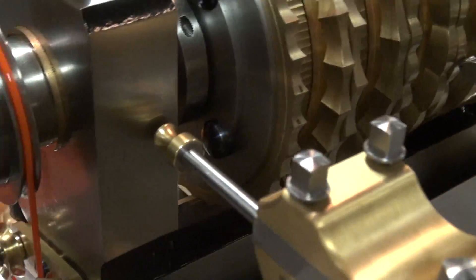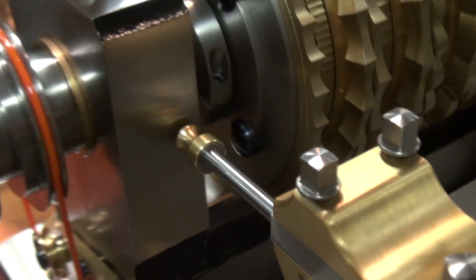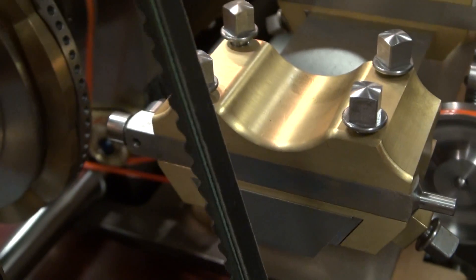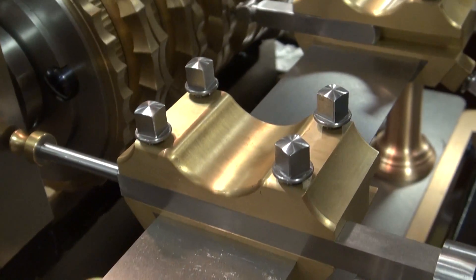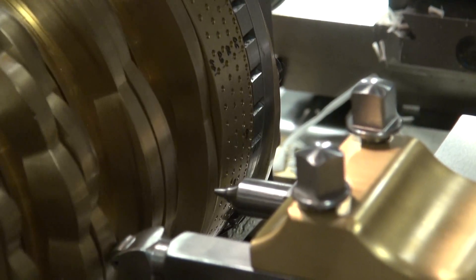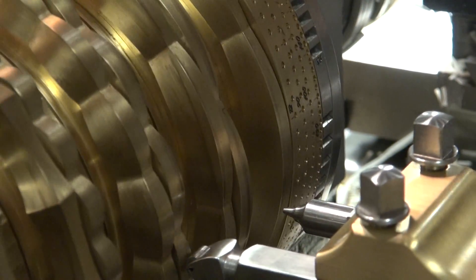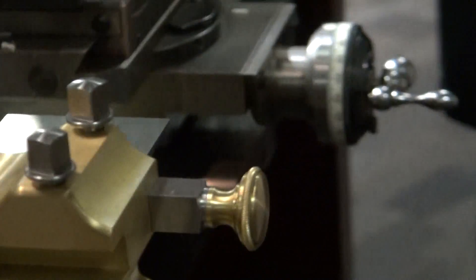Those are a 72. I really like a 72. Is that cut actual? No, I don't particularly like that. I'd rather index it. I don't either. I actually index them with the index band. But the 72 or the 96 — it's not a rosette, it's a hole. It's a spring-loaded pin. It goes in these holes. So I do them individually: make a cut, index it, make a cut. That's the old way.